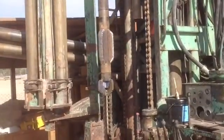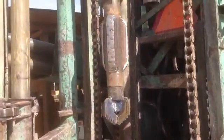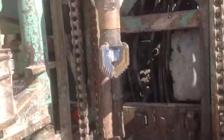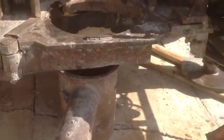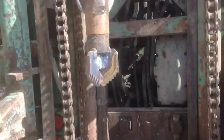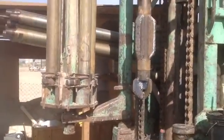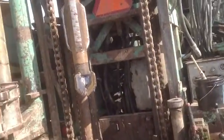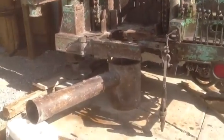You want to go down to 240 feet. This is the drill bit that will go through the dirt and make the existing well deeper. That drill bit is about 3 feet long, and that's the existing well right there. The well is 140 feet deep, clogged up after 20 years of use, and now this drill bit is going to drill down to 240 feet.